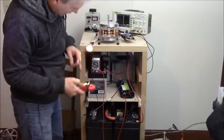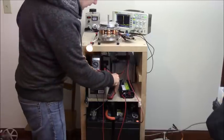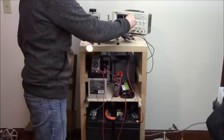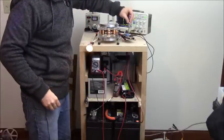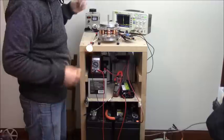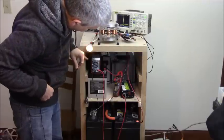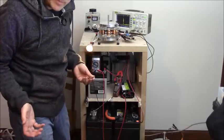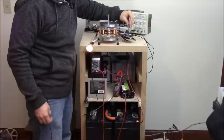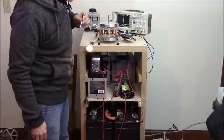Now I'm going to be pushing a lot more amps. Of course, we're actually charging less because I've increased the on time. So I have now 3.5 amps, and we don't want that. So we're going to turn this down. And it speeds up because I have this shorted. And so the battery is going to charge faster now with the less on time. So we'll go right down to, I was running this at 1 amp before. So there's a sweet spot to this one.